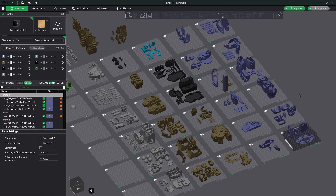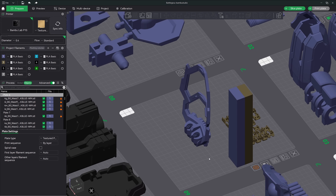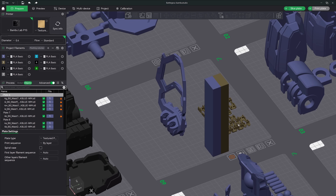Tip number two: print sequence. Let's move on to the next feature which will come in handy and may save you some time. Now as you can see there are over 100 models to be printed to complete this project. Let's say we happen to miss two models and they need to be printed in two different colors. The first thought would be to simply print one model, wait for that to finish, then print the other. But there's actually a better way of doing this without having to change colors for every single layer — we can print both models separately, one at a time, for a single print.